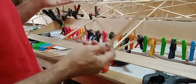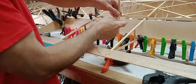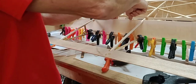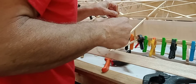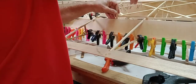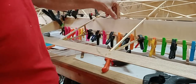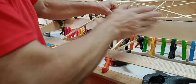One thing I didn't mention — because I forgot — is that you're going to have to put an upright clamp on the bottom, vertical, halfway between here, because you do need to clamp this in at least three places along there. You can't just clamp it to the web itself because there's not enough space there. When I had the wooden clothespins, I just shaved them down thin enough that they'd reach straight down in there and get clamped, but I don't have them, so now we're going to have to put another clamp all the way across the spar, clamp it against there — not very tightly, though, because it will bow it if you go too tight.